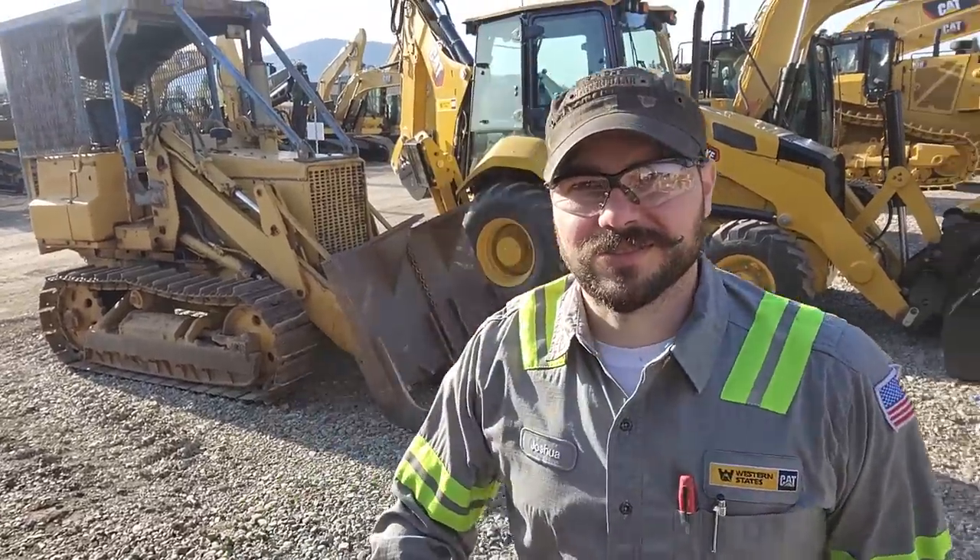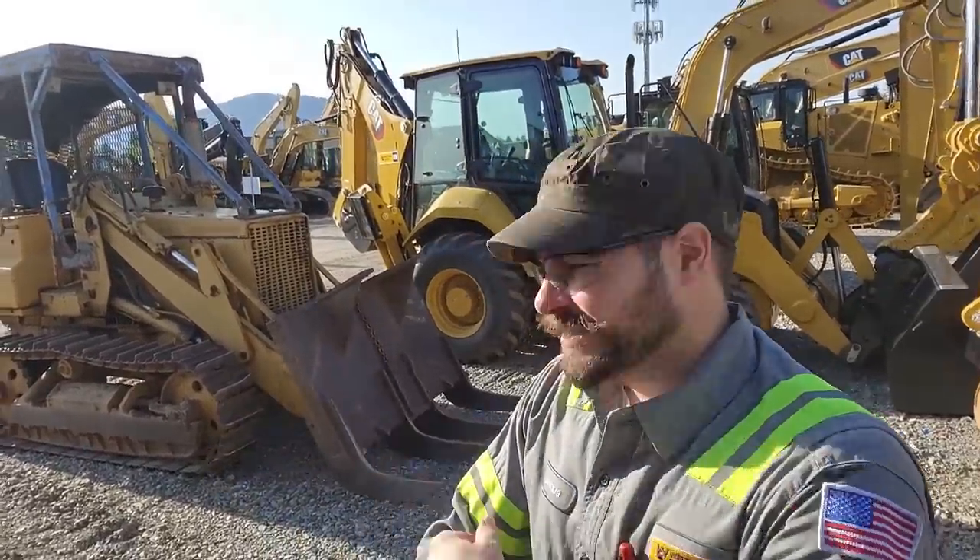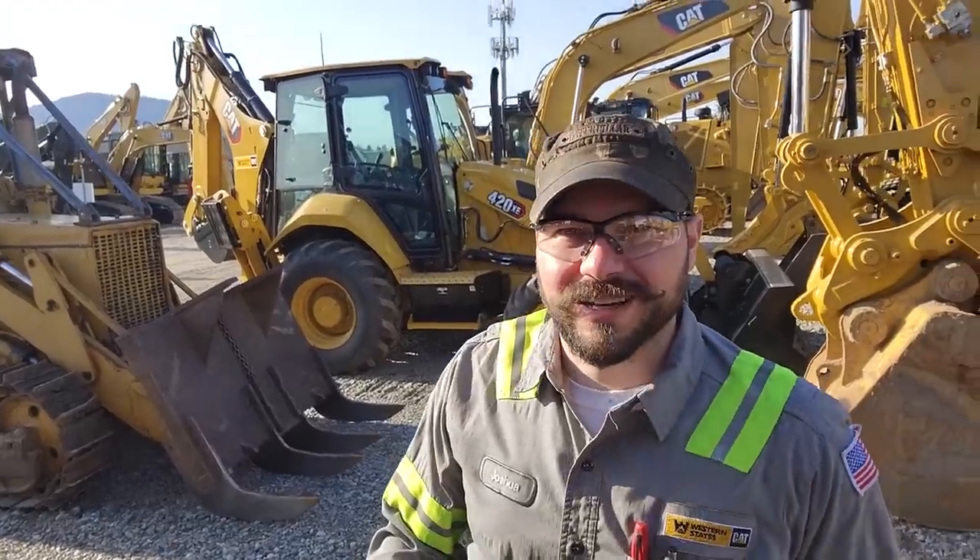Hey guys, Josh with the update channel. Look at that old dozer there — that thing's pretty cool. I don't know what's going on with that blade it has, some sort of zombie apocalypse thing. So we're working on the D8 today. I got a lot of comments from people saying how I should troubleshoot the D8 in the previous video. I was told to remove the cylinder head to look for signs of the oil issue inside the engine. Pulled the cylinder head, didn't really see anything internal, but found there was oil on the valves. So it has been decided that the head is going to be replaced. We're going to be putting that new head on and hopefully that takes care of the problem. Let's get to work.